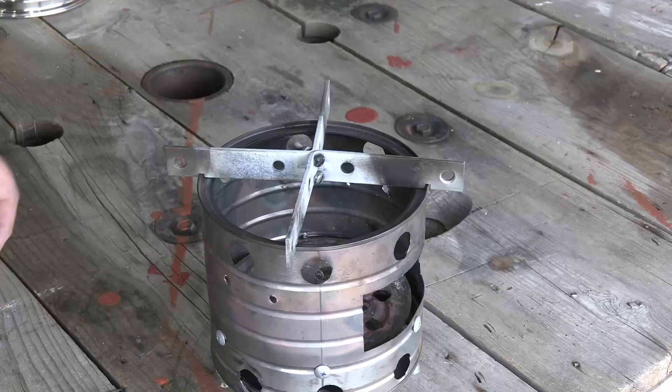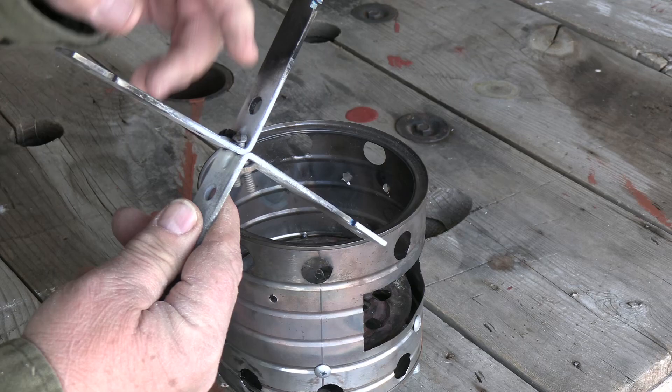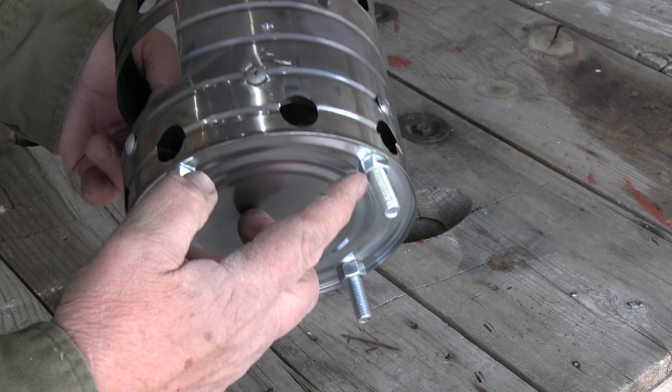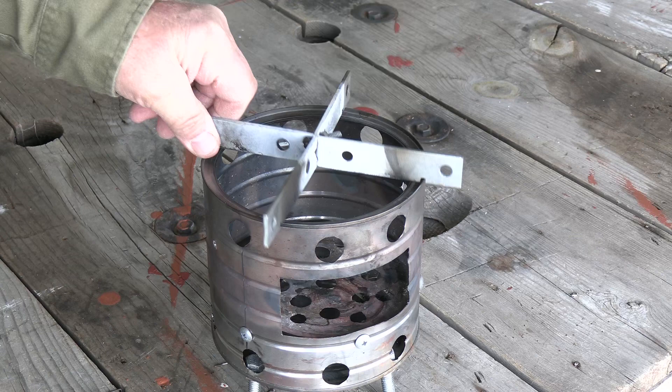About three months ago I did a video on how to build a hobo stove. I used a coffee can — you can use a number 10 bean can, something you can find on the bottom shelf of any of your grocery stores. The most expensive part of the whole build was actually buying the can of coffee. Now this is the hobo stove that I built. I made this trivet out of a couple of pieces of angle and a couple of screws that I drilled through. I drilled holes around the top and bottom of it, put some nuts and bolts in for the legs, took a top of another can and drilled holes through it — like a little grate for the ashes to fall through. So that's what I built.